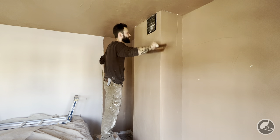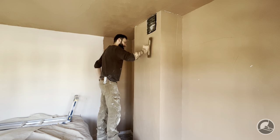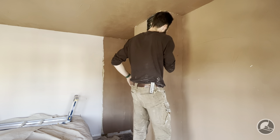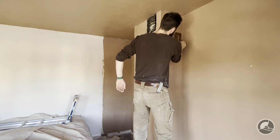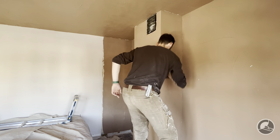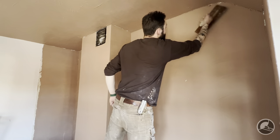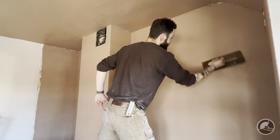Pull down and then roll back up - these are high ceilings so just pull back up like so. Same with this one here against the beads - pull down, back up, make sure that bead stays nice and square, and then go into the corner and pull out like so to get that corner nice. On this section of wall where I applied it up and down, I'm going to flatten it side to side - the opposite way to how I applied the plaster.